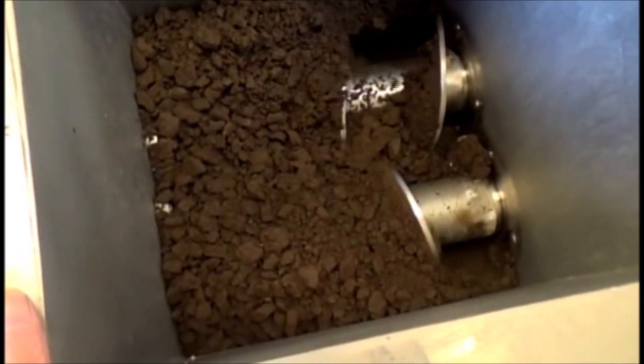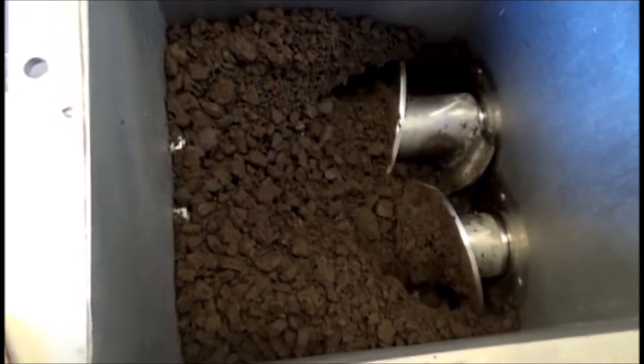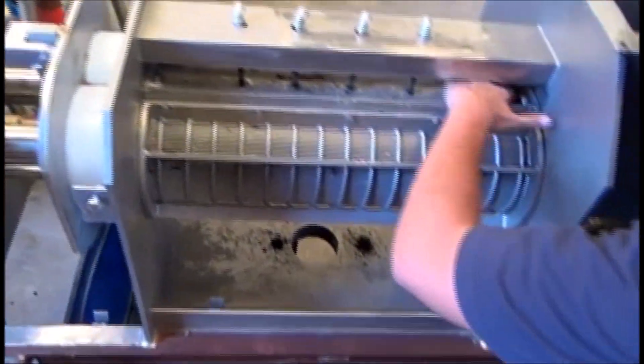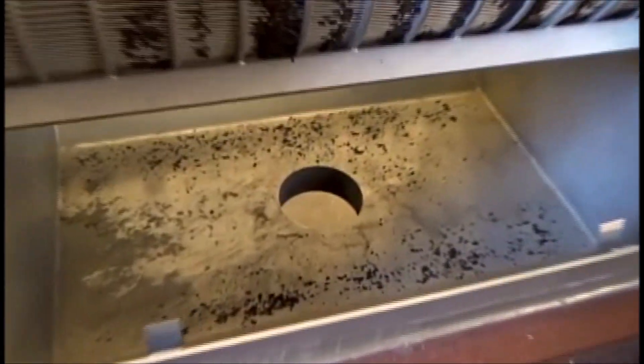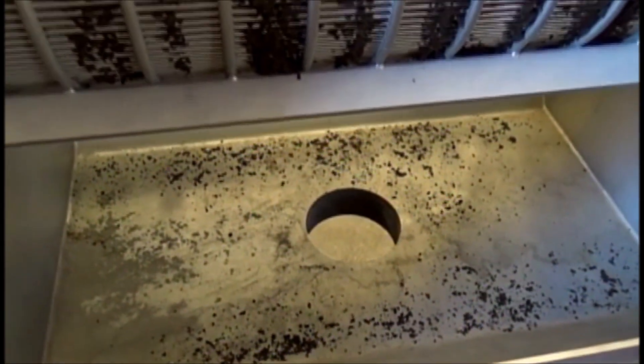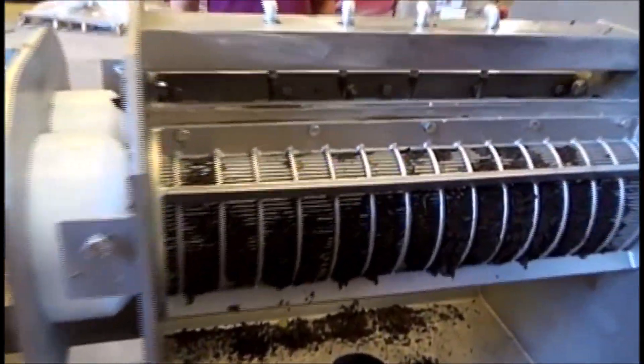It's feeding the cone. This is crash material that we're feeding in now, taken from the second pressing pile and other stuff. With the 0.16 slot width, we're forcing the material through the screen. The screw shaft is tapered so it pushes material outward. We're going to have a contaminated oil sample. It's squeezing some oil out along the edge here.